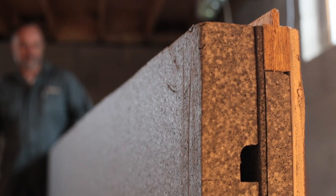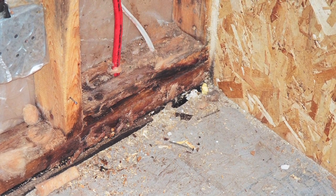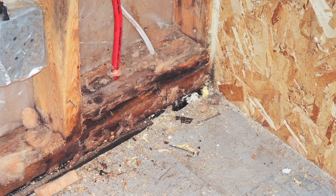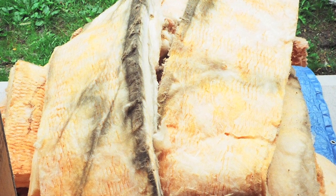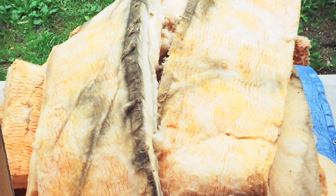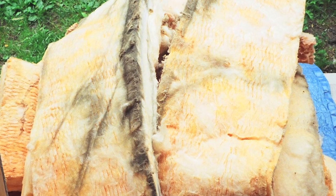The main problem with fiber insulated stud frame walls in basements is that they're so vulnerable to water — either liquid water or water vapor. It's not unusual for insulation to get damp and sometimes even wet, and that's just like sealing a used bath towel in a plastic bag. Mold and mildew are inevitable in situations like that. Even seemingly dry basements can allow water vapor to pass through masonry foundation walls, collecting inside sealed stud frame wall cavities during warm weather.